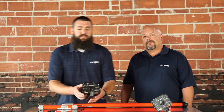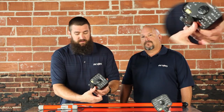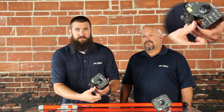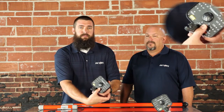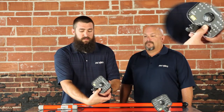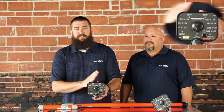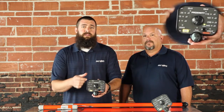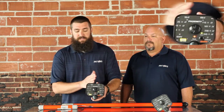Casey, let's go through the power-up sequence. To turn this unit on, we have just a single button interface right here on the front. This is made to be used with a gloved hand — it's quite simple to operate. You just press and hold until you hear the alarm chirp, and after the initial chirp, you release the button. The unit is now going through and testing each of the LEDs and testing the audible alarm on each of the ranges.